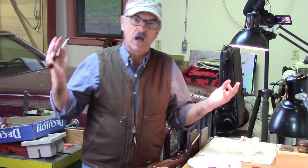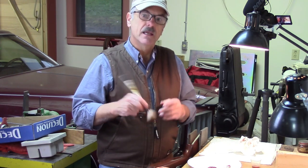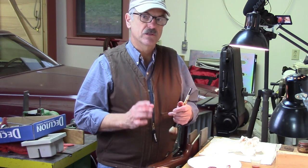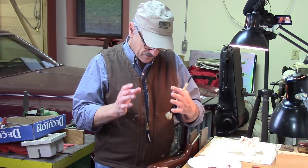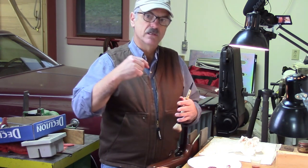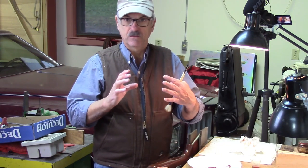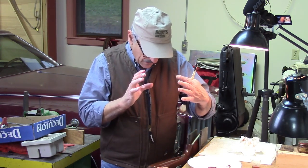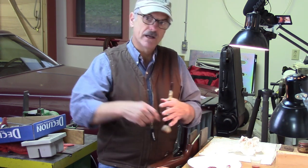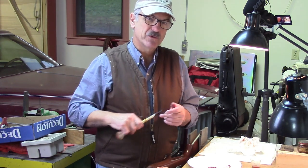Here's the problem: I need to wait at least 12 hours to let this harden. If I go back and try to add another layer while that lower layer is still soft, the finish — which is the binding agent — needs to dry. Because the oils are mixed in with the finish, just like paint, this is going to harden, and once it solidifies I can put the next layer over it. I'll see you in about 12 to 24 hours.